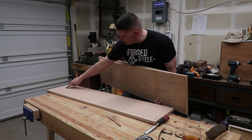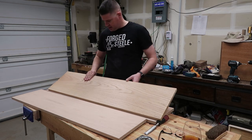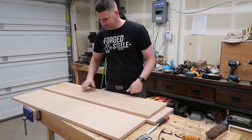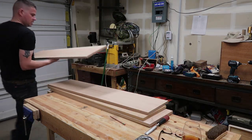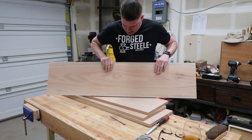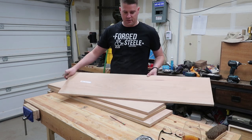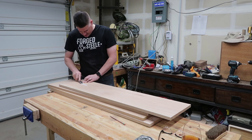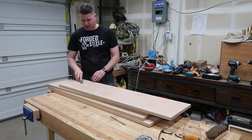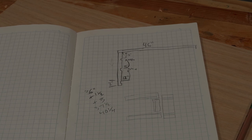What I'm doing now is marking everything out — what's going to be what. This is going to be one of the sides; I'll cut off the end here, it's got quite a big crack on it. I'm looking at the grain on this piece and I think it will make a nice side or even the top. I'm labeling everything so I know what to cut. Lowe's sticks stickers on everything, so I'm taking them off and wiping everything down with acetone to get rid of the residue so it doesn't mess with any finish.